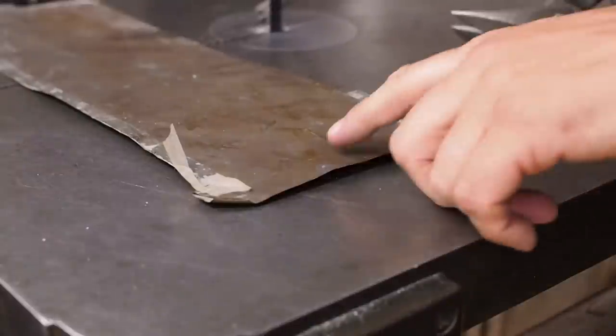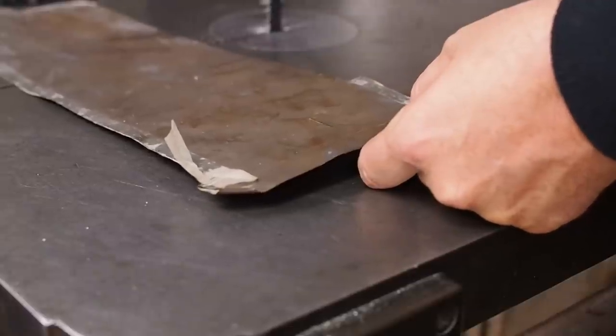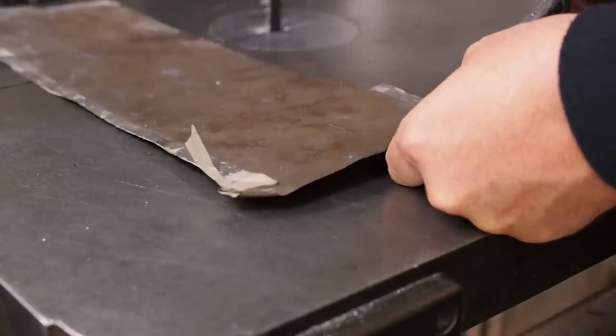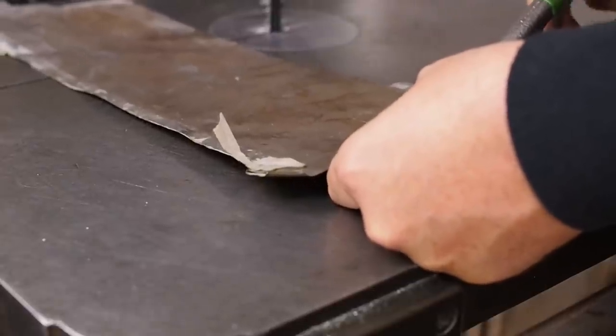Now, thinking a little bit more about it, 0.4 millimeters would be the minimum thickness shim to bring it up to height, but there's a bit of slop in that rolled ball screw, so I think I'll go a wee bit further and use two layers of this brass shim stock to bring it up by 0.6 of a millimeter and see how that looks.